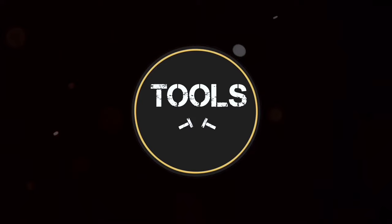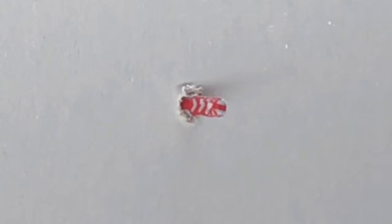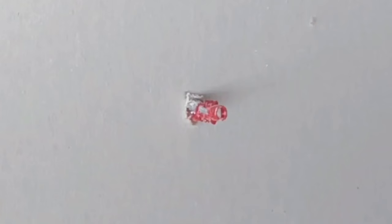The first anchor is a quarter inch Hillman anchor. It's a small red one that pushes into a 3/16 inch pre-drilled hole. The way we're going to test the strength of these anchors is by attaching a bracket using the supplied screw that came with each anchor. This anchor requires the screw to be turned after it's all the way in, so the plastic anchor can ball up on the inside of the wall.